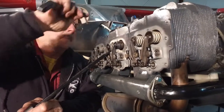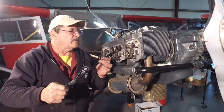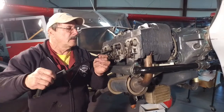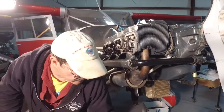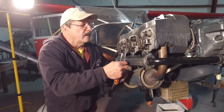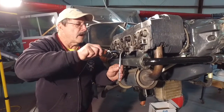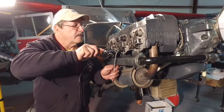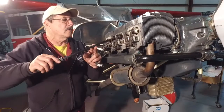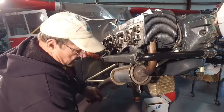Here's our feeler gauge again. That's pretty good. Now, this not only works on Franklin engines — Continental advises you to do the same thing. Bleed the lifters down, is what they call this. And all you're doing is pushing the oil out of the lifters. The last IA seminar I attended, a guy was telling me, 'Oh, that's awful hard to do.' He sticks a welding rod down in there, down in the push rod, to bleed the lifters down. You don't have to do that. If you use this tool and go about it nice and slow, you can actually watch the oil go out of the lifters.